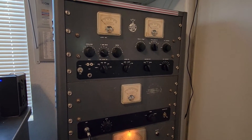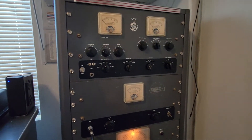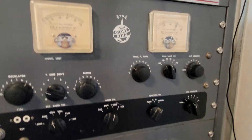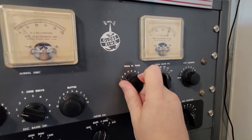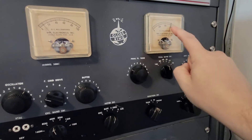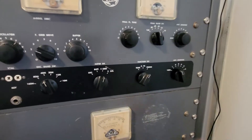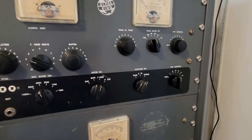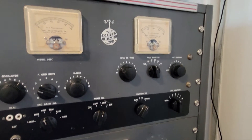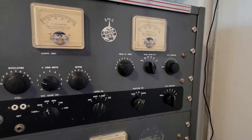So the final thing is to move the function switch over to phone. Now we're at high power — we're ready to do a final tune. We're going to go ahead and flip the plate switch. We're about 300 milliamps — we're going to make sure it's dipped. We're a little low; we don't have enough loading cap to quite make 300 or 330 milliamps. So we have to unkey this. We're going to just experiment and advance one level on antenna coupling. These antenna loading caps in here don't really have much capacitance, so on a lower band like this they almost do nothing — it's not going to make more than maybe 20 or 30 milliamp difference.